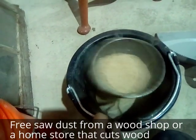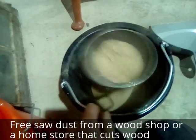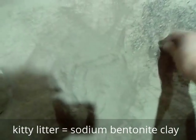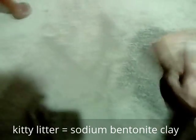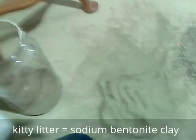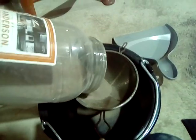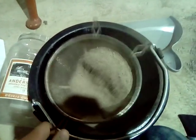I'm now sieving a bunch of sawdust — a one square millimeter sieve should work really well. I've taken kitty litter and using a brick I've just kept working it against the concrete floor back and forth until I turned it into a fine powder. I swept up the dust and I'm going to pour it right in here to take out the bigger chunks. I'll just work it back and forth. It wouldn't be a bad idea to wear a dust mask.